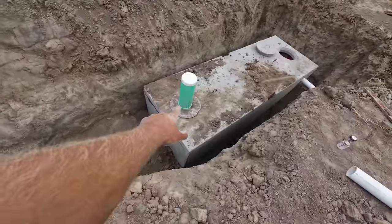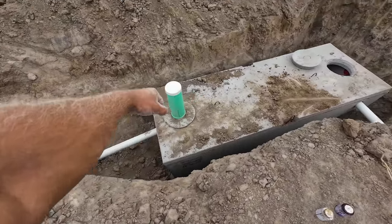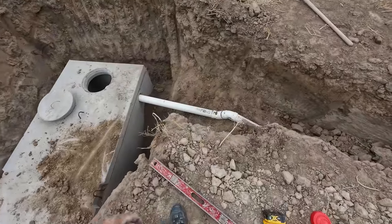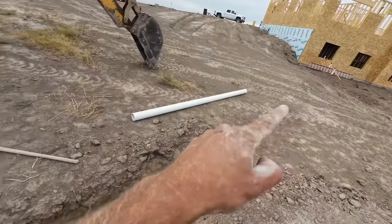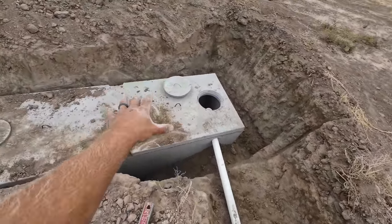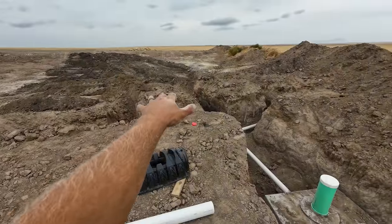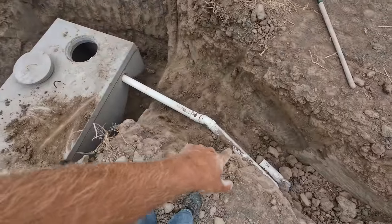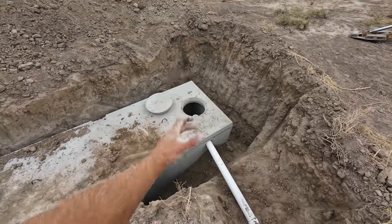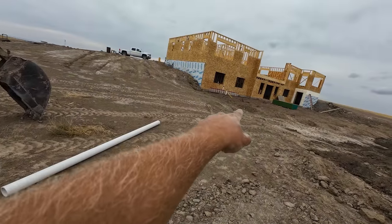We're all connected - diffuser box, everything's good. I got the screen in for the leach field so it can be pulled out - just grab the little PVC pipe handle, pull it up, clean it, put it back in. I also just finished plumbing the run from the house to the septic tank. I had to put a 45 and a 45 to drop it down - when I dug the hole for the tank I dug it just a hair too deep, about a foot, which dropped everything down a foot. Too late now - I'll just bury it, it'll work. Got my tee in there, got the lid, and I'm going to get a riser so we can pump it in the future without having to dig.